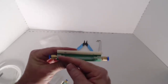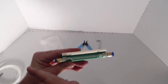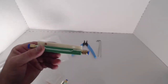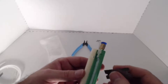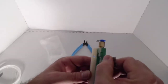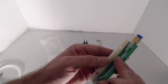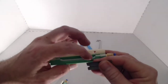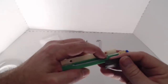As long as it's down below half the height of the filament, you should be good. So when a filament comes through here, it's going to press down and ride in this channel and just go on through. This is going to allow the friction pad to come in a little bit later on and just slide back and forth on there. Now I do want to show you a little caveat to watch out for — I intentionally did it on this machine — and you'll notice that in this case we have a little bit of proud area right here, so this is standing a little bit higher than it should be. By having it too tall, the friction pad can actually rub against the PTFE tube instead of just the filament, so we want to make sure that we don't have proud areas like that.